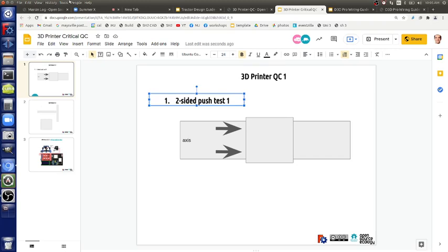So observe for that. Because you can definitely get super loose, less than 2 pounds, but you can do that very easily at the expense of being so loose that you're just wobbling. And that will determine the quality of your prints. If you can see visible 1 millimeter wobbling, the real figure of merit is compared to what? How big are the print threads? We're printing with huge nozzles, which are 1.2 millimeter. So it will work. It'll get you rough prints with 1 millimeter offsets if you've got a little visible wobble. It'll still work for a big part, but it won't be as clean as possible and super neat. So do this two-sided push test